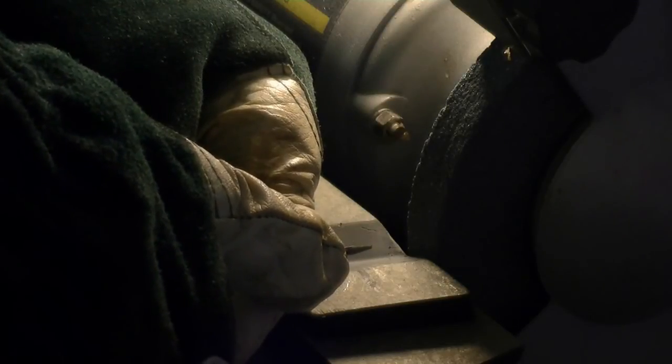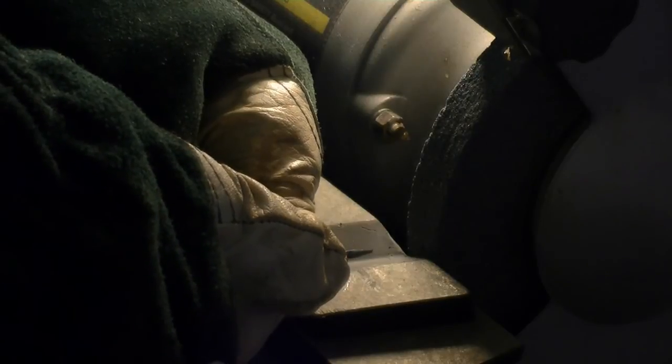By grinding a sharp point you'll be able to control the arc at very low amperage and have a very defined cone. Having a properly ground tungsten is very key to keeping a clean, stable arc. If you dip your tungsten into the puddle or accidentally add filler into the tungsten, you're going to need to re-grind it every time. If you're practicing you can sometimes get away with it, but if you're doing a serious weld, re-grinding a tungsten is just part of being a TIG welder. If you have any more questions, please give us a call at the number listed at the end of the video, and as always, thanks for watching.